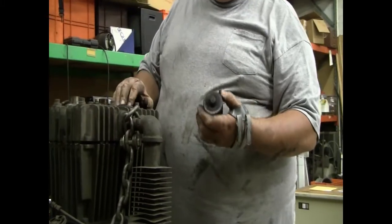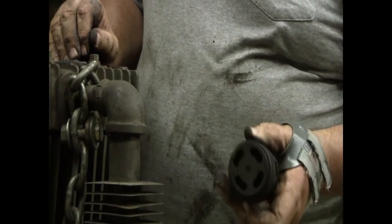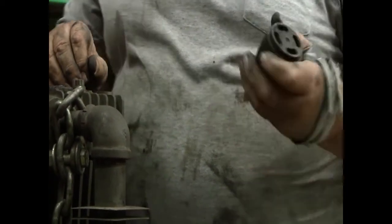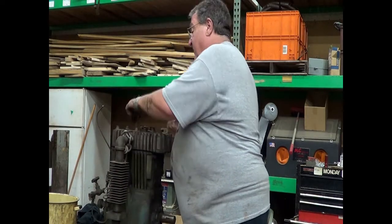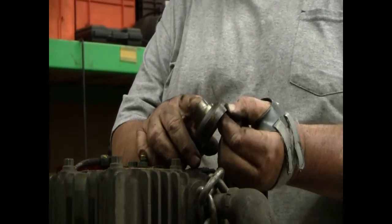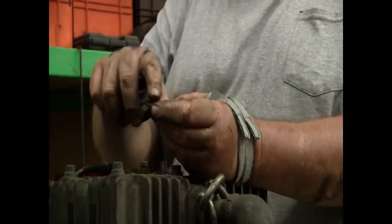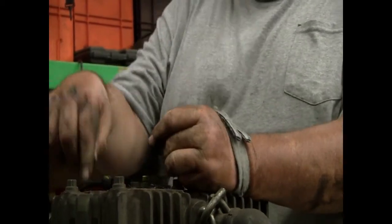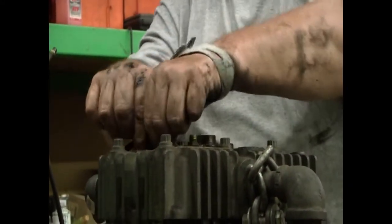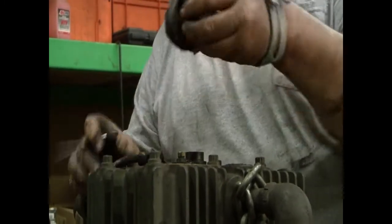This is an exhaust valve. Does it look damaged? No — this machine was pumping when it came in; it might be worn out but it was pumping. This is a different kind of hold-down: the screw goes against the outside of this radius here, and the unloader pin pushes down on those pins right here. That all looks good. We will take a lot of time when going back together with this machine, especially during the valve rebuild and reassembly portion.